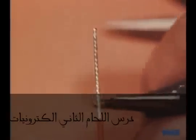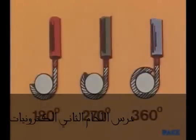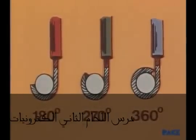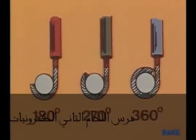Using a pair of chain-nosed or round-nosed pliers, the tinned end is now formed, the loop is cut, and the wire placed in position for soldering. The actual size of the loop will vary depending on the specifications for the particular job. The loop may be a 180-degree one, which makes removal easy, or it may be as much as 360 degrees.